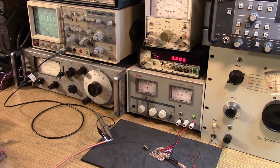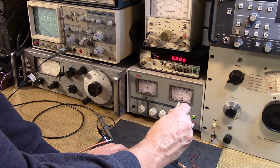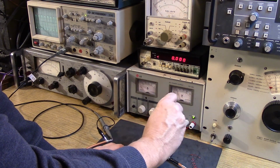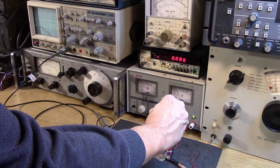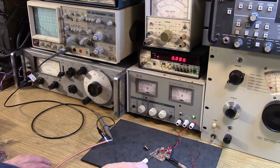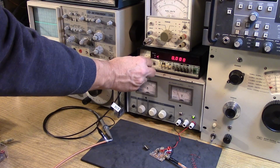So let me show you what double tuning is. This is what we're going for with the oscillator. There should be 2 points on the trimmer in a fairly even sweep of the hemisphere of the trimmer that you get peaks. There's 1, 2. That's called double tuning. Now, we're at the very low end of the trimmer's capacitance. So I've removed 5 turns, and I still have too much inductance. Also, make sure you're at 40 megahertz. So you can check that with the counter.